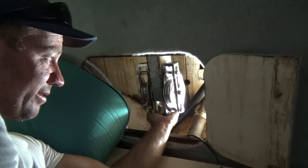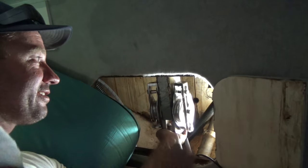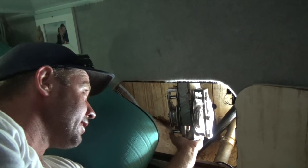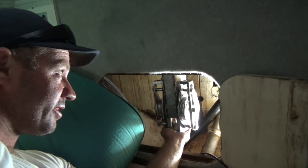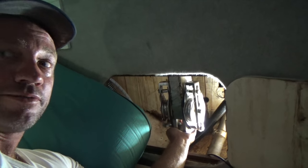I've actually just mounted it with four coach bolts right up into the members - pretty much just to temporarily hold it until I actually get my bolts through, but it is that solid. I can't even move it a mil. I'm still going to bolt it, but I do need a right angle chuck so I'm not able to get my drill in and drill through the beam up there. I want to put some 10mm bolts through there. It probably doesn't need it, but I like to do everything with a little bit of overkill.